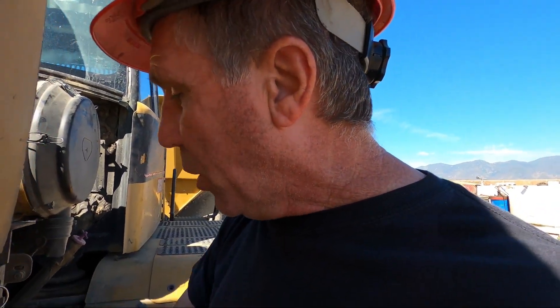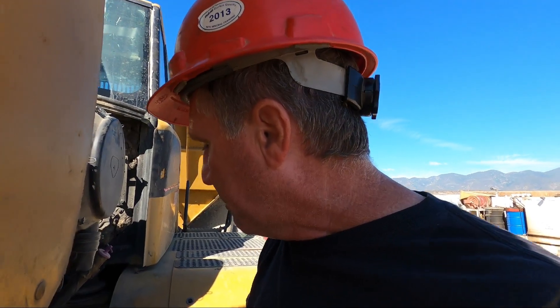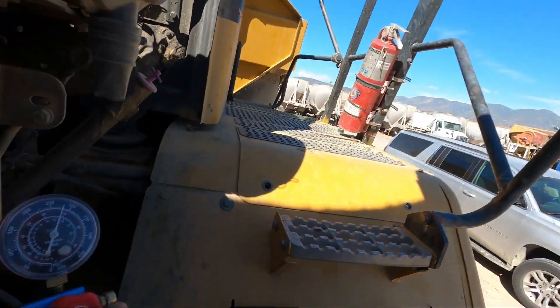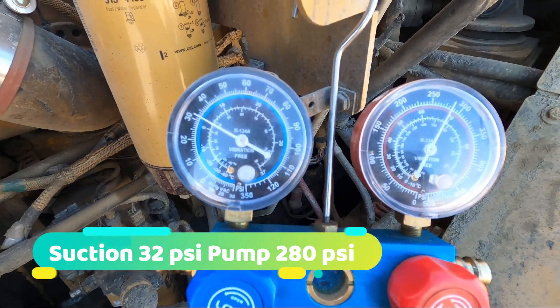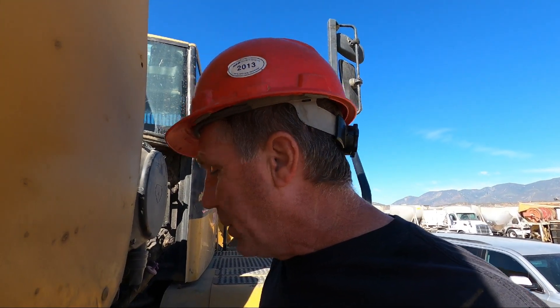I'm going to let it stabilize for about a minute. My low pressure should sink down a little bit more - my high pressure's about 275. Yeah, stabilized at 32 psi on the suction side - I'm extremely happy with that. I've repaired hundreds of these things and that's the way I do it. I know other people weigh the freon exactly or have different methods, but I've been doing air conditioning on heavy equipment since the early 90s, so it's been working for me.